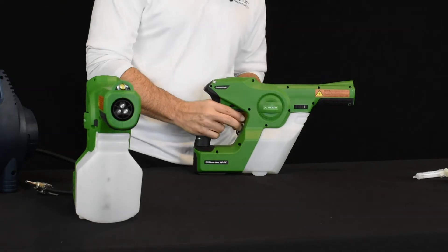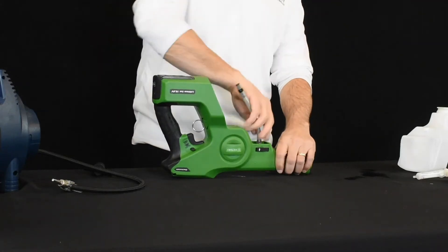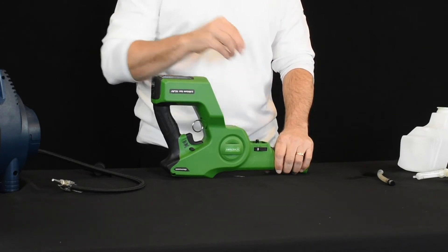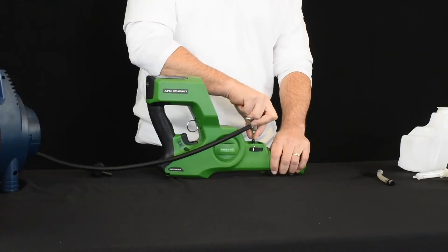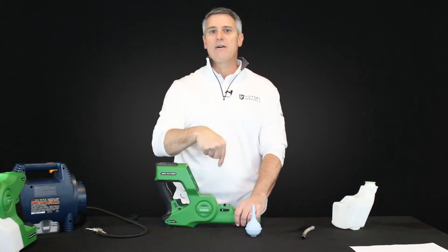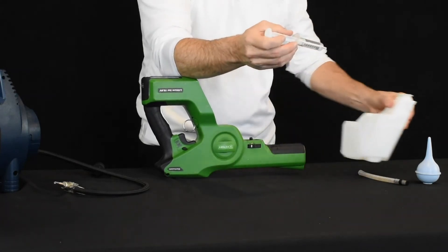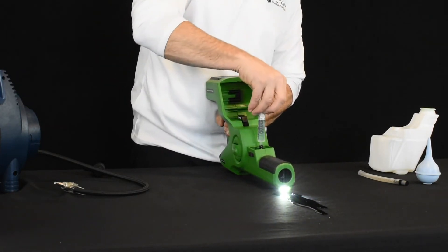In step two, remove your tank, set it aside, and flip over your sprayer. Go ahead and pull off your hose. What we want to do here is either send air or water through that waterway to release any stickiness that might be on your valves and your pump. You can do this by taking forced air through a compressor or by using a syringe or water bulb to send liquid down through that system. I'm going to show you using a syringe — simply stick the syringe down into your tank and grab some of the fluid or chemical you've got in there. Then while pulling the trigger and running the unit, shoot water down through there.